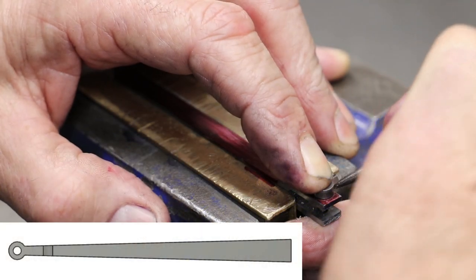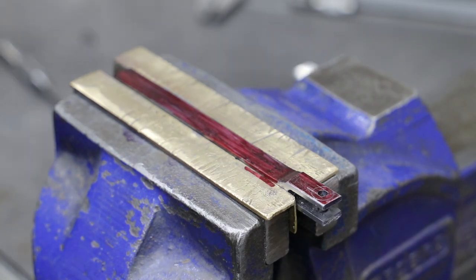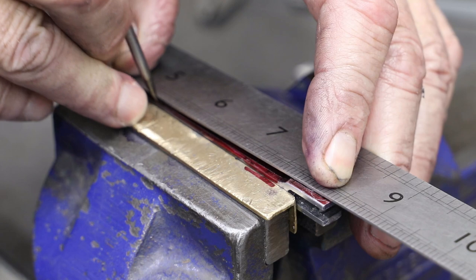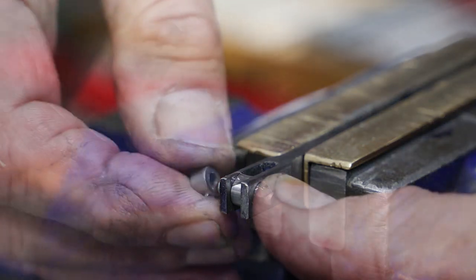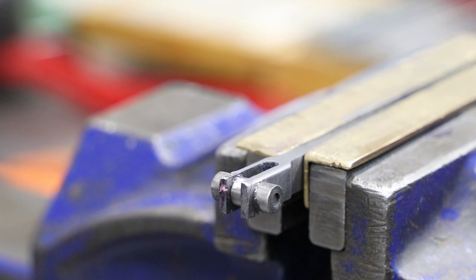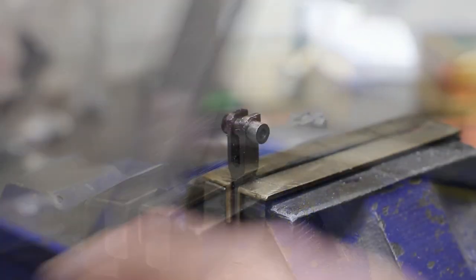For the side profile, I do use a Sharpie, the advantage being it dries much quicker. As usual, I use a couple of hardened filing buttons for the rounded end, but this time I glue them in place using Loctite. I also fit a spacer between the two prongs to prevent the forks from getting bent.